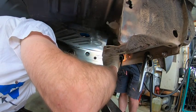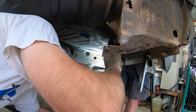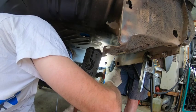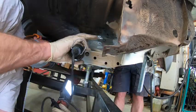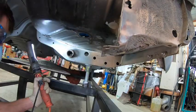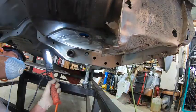It's the side closest to the rocker panel right there. In the last video you saw the top side and how we struggled up there. We actually end up in a later video cutting this out and putting a patch in because it's just way easier and ends up better. When we're all done with the grinding here, we'll also put weld-through primer on the floor pan and get it ready for frame rail fitment.